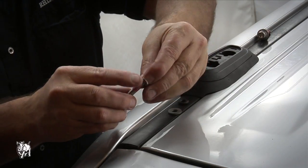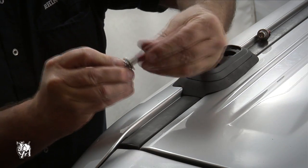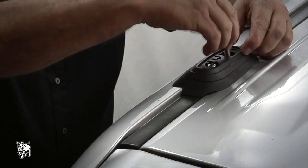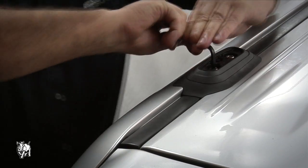In order, place the spring washer, flat washer and O-rings onto the M8 x 40 mm security bolt, pushing them up to the head of the bolt before locating into the mounting pad. Tighten all M8 bolts using the 6 mm Allen key supplied. Do not over tighten.